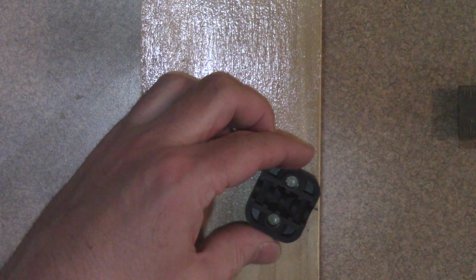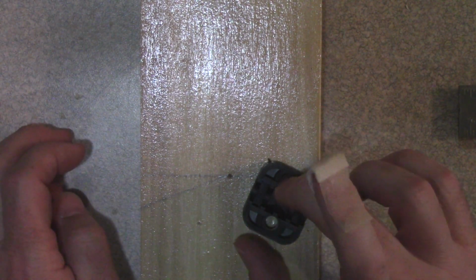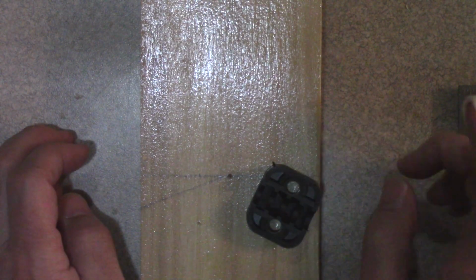And then with the protractor, I've drawn lines here at basically a 20-degree angle. The exact angle is 20.4 degrees, but that will be adjusted at the other end of the element by how close it is to the reflector element. And so again, we'll put down the clamps here and line it up along here, but we'll only put in 1 screw here until we get it just right, and then we'll screw down the other side.